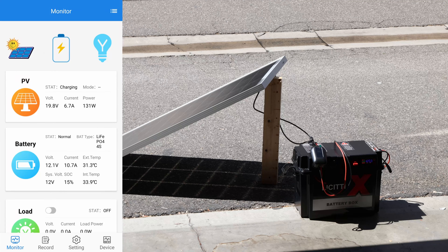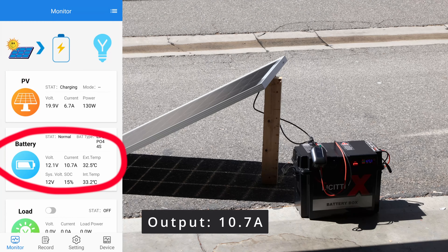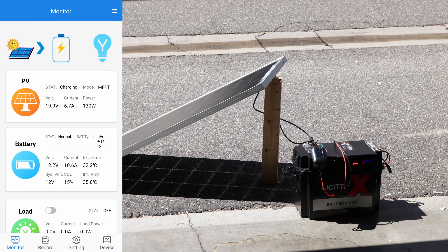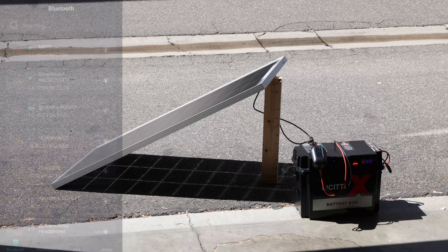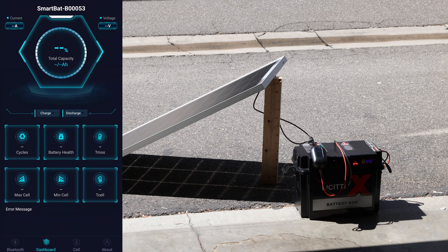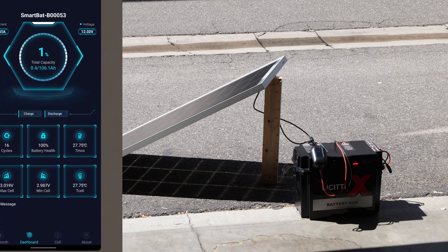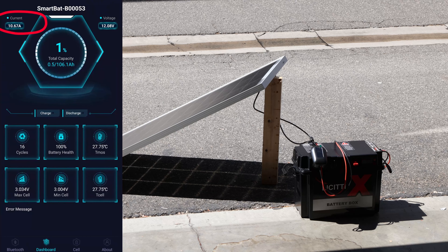Going back to monitor, it's still in MPPT charge mode — looks like around 20 volts. It's a neat little device which I enjoy because it has Bluetooth so you can always check what's going on. Switching to the battery — I'm using the Lithova battery, so connecting to the SmartBMS we should see what's happening in the battery. It was completely dead. It says current coming in: 10.35 amps. So we can see the battery is charging — it's a 12 volt battery receiving a little over 10 amps, which aligns with the MPPT charger reading.